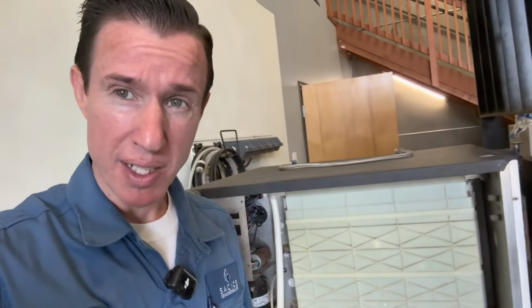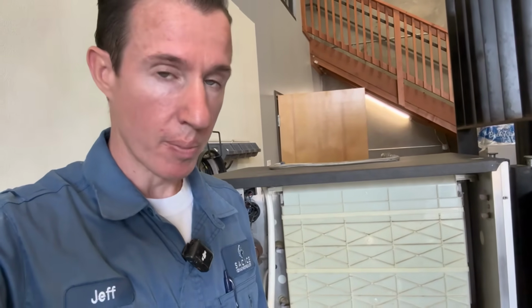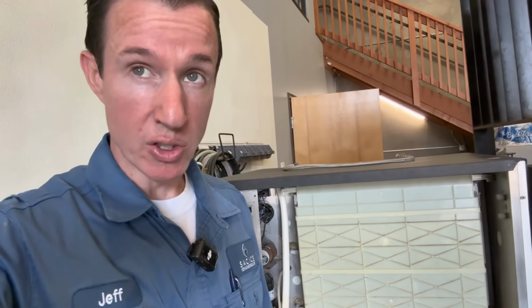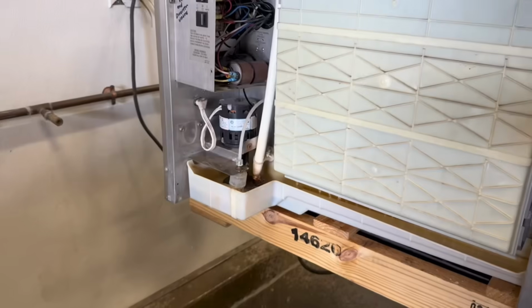Turns out this thing's making ice just fine. I can hear the ice cracking. It's got a full sheet formed. I'm kind of worried about whether or not the timer initiate or the finishing timer have anything wrong with them, but we'll let it go for another 10, 15 minutes. And if it starts turning into a big block of ice, we'll dive into that. But if it makes ice and drops ice, then we'll just chalk it up to a couple of burnt wires.